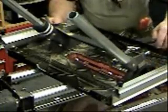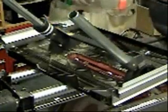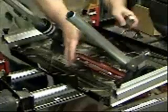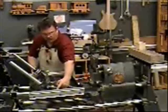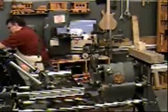But then I'm going to take the back right bolt and snug it up, just snug, finger tight, that's all. The reason for that is that if I were to put this back on and try to align it with all four bolts loose, the table would just slalom all around. I'd have a very tough time with all the slaloming that it's doing. By snugging up this bolt in the back right, it becomes a pivot, and the table just pivots. It's much easier to align. All right. One last thing, and this is really important.